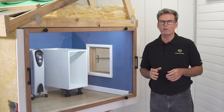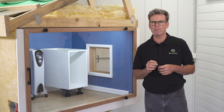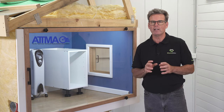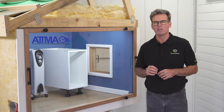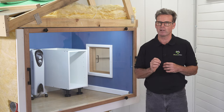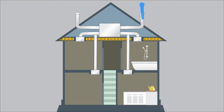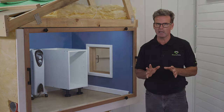In this video, we'll be addressing ventilation, air tightness and insulation issues for plumbing, electrical and joinery at the finished stage of construction. Failing to properly ventilate the building can increase the risk of mould growth. Should you get your home below three cubic metres per hour per square metre at 50 pascal, it is recommended that you integrate a heat recovery ventilation system into your home, which provides filtered fresh air combined with a process of recovering the temperature of the exhausted air and applying it to the new incoming air.